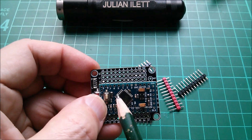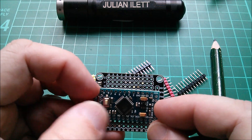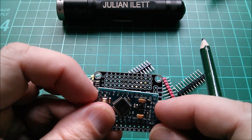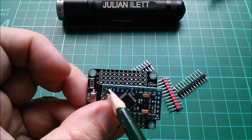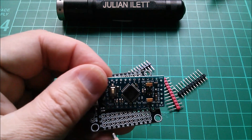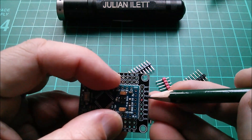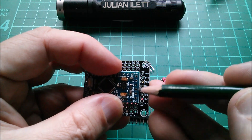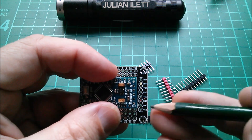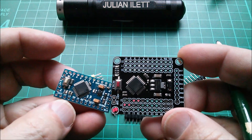Well, it's not entirely pin compatible with the Pro Mini. If I line them up - TX, RX - it doesn't quite line up. If I put it there, pin 9 lines up with pin 9, but pin 10 is here whereas on the Pro Mini it's actually on the other side. On the bigger board the other side starts at pin 11. I believe we have TX, RX, 5 volt, ground - and green might be DTR, then the bigger board has a V-in which is the raw on the Pro Mini, and a reset. So it doesn't quite line up - it's not quite pin compatible.